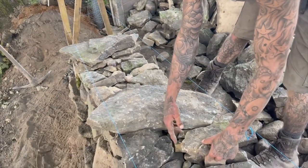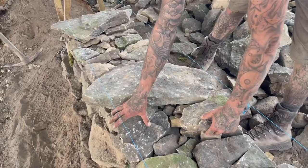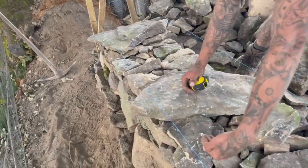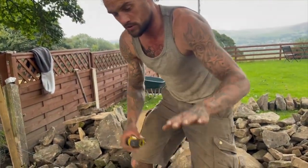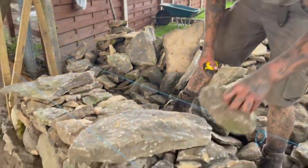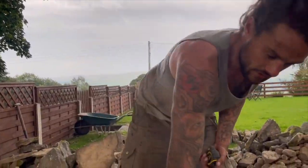we've got a lot of space in the middle there, which we're filling with these filling stones. So what we want to do is try and get as many bigger stones in that primary lift that can reach into the wall, and then there's more friction with the course on top to compress that wall and make it a solid structure. So once we've got that course of walling in, we're left with the voids in the middle,